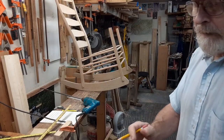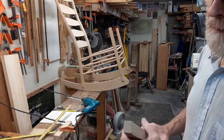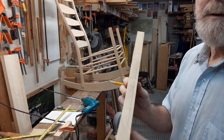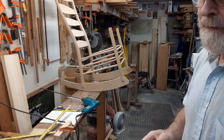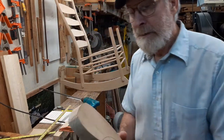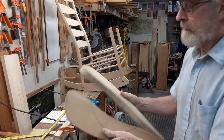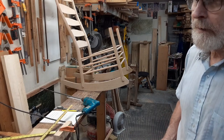When I start in with my drawknife and spokeshave to shape this, I might start working on one part while smoothing up other places as I go. I'm probably not going to be able to completely finish the shaping of the arm until I get the tenon on there — I can rough it out and get moving toward the final shape. Remember, these arms are a mirror image of each other, so know where the bottom is, and try to make both arms look fairly similar.